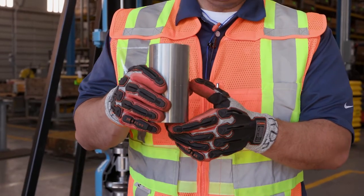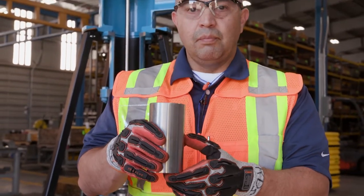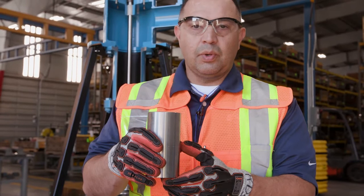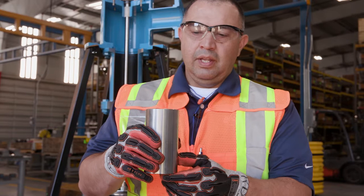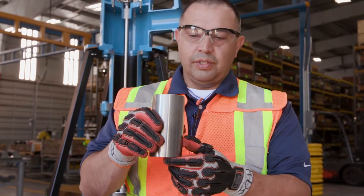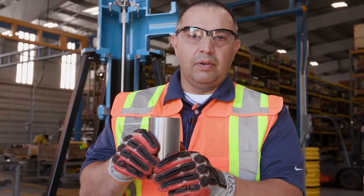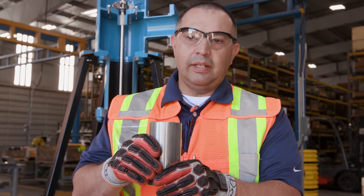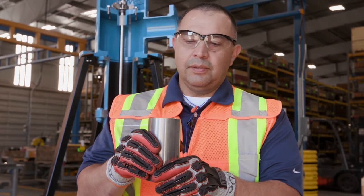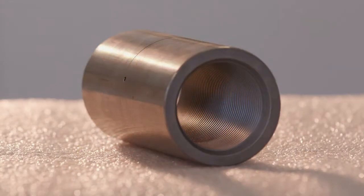We can use it with mechanical seals, but on the vertical hollow shaft motor a steady bushing is required for additional rigidity and stability of the shaft. Whenever you use a threaded coupling, the lateral will be adjusted at the adjusting nut on top of the vertical hollow shaft motor. The lateral is the lift on the impellers off of the bowl seats. This coupling is used with our cast iron or fabricated steel discharge heads.